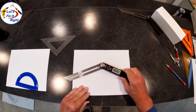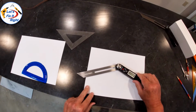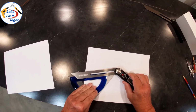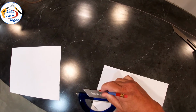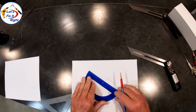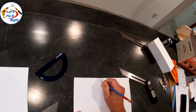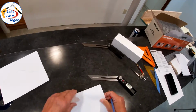I'm set up here on my bar near my workshop in the basement, so you can clearly see how I'm working with these angles. My Husky angular measurement tool rocks a little bit because of this distance here, so I'm going to stabilize it a bit to make it easier to capture accurate angular lines. So at this time, we'll draw 2 angular lines. Once again, this represents the left corner angle of the kitchen cabinet. We have the left and right lines perfectly captured, and we'll extend them to identify the apex of the angle. We are good to go, and once again, this is the left cabinet angle. And we use the same process to capture the right cabinet angle.